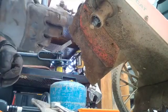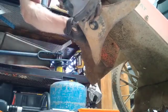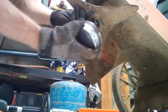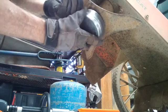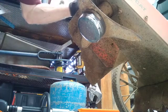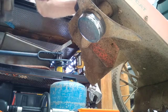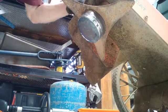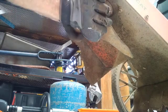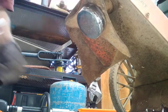There we go. This bushing goes up inside there like so. Then the blade, and then our newly repaired head. There's a slot on the back side of the shroud here where a 9/16 wrench goes through and engages a nut on the top of the spindle shaft here. And then you just hand tighten it like so. Done.